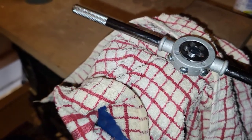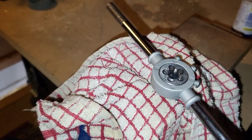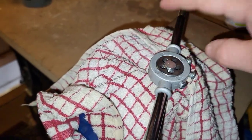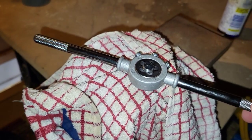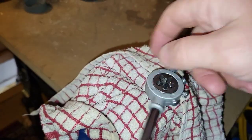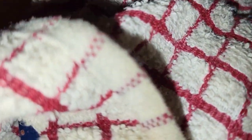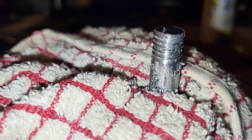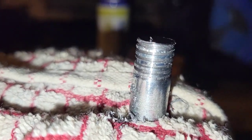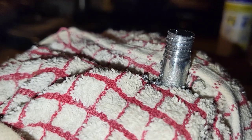So there we go, I think we've got it. It cut the metal no problem. It's quite hard to get it straight at first but it's kind of evened itself out. That is all the way down — we've gone all the way down to the deepest part we want. I'm quite happy to see whether it's put a thread on that groove, so let me have a quick look. I think that should be okay. I will be looking at getting an M12 nut and seeing how we do — if that doesn't work, then we'll go down one, but for now it all seems good.